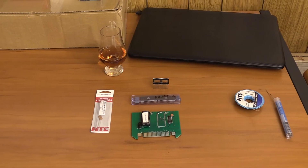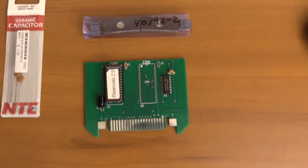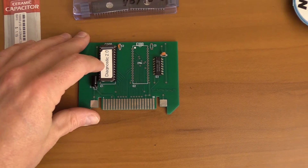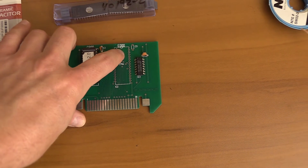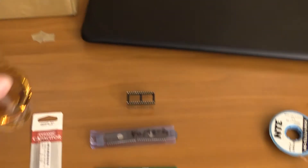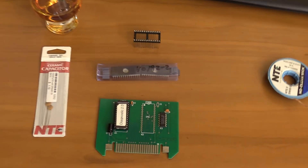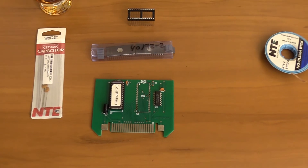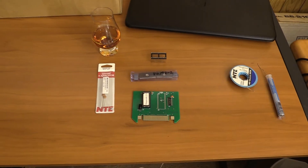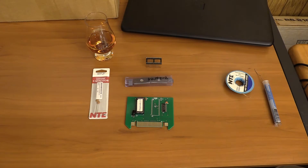What are we doing tonight? We're gonna make ourselves a program pack. Well, not really make - this is a board that I bought from Ian Maverick. This is one of his The Right Stuff reproductions, and a very good one. It has an 8K diagnostic ROM in it, but it has the socket for the other 8K ROM and an additional capacitor that will have to be installed. Nothing terribly earth-shattering, but something I've always wanted to do. Now I can and now I will - we're gonna make up for some lost time. In fact, this is a pretty pointless project - you could use one of the flash banks in the Super IDE or the Coco SDC, but there's just something fun about burning ROMs.